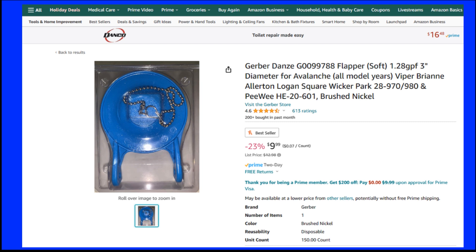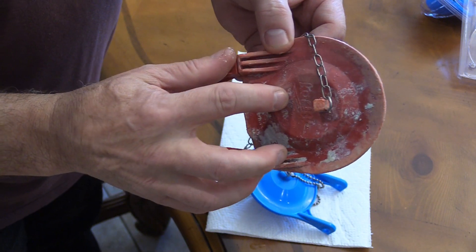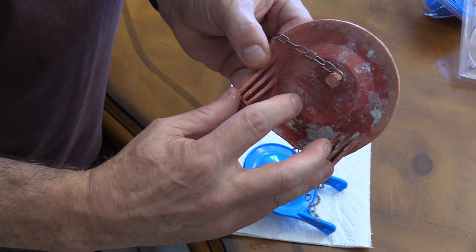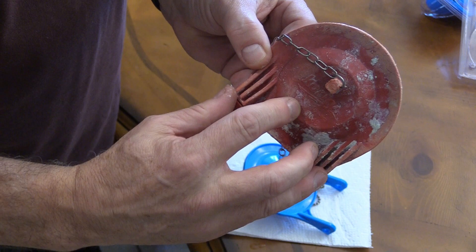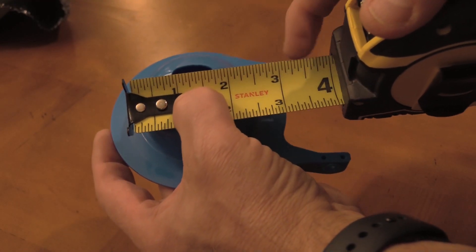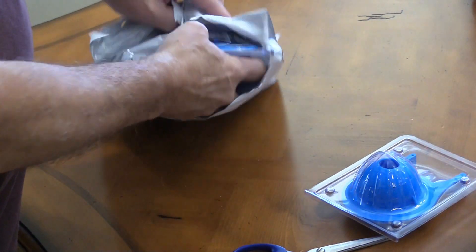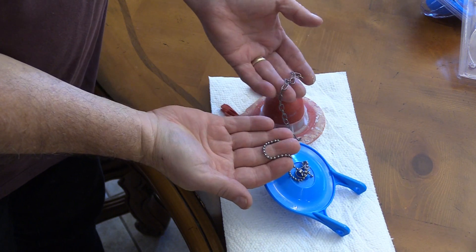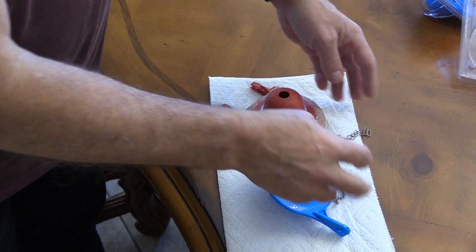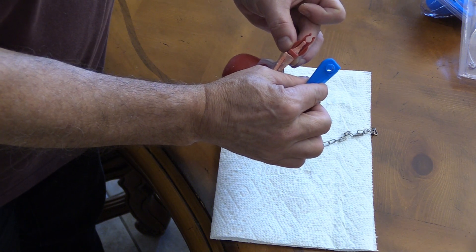You can purchase it on the manufacturer's site, or you can click on my Amazon affiliate link below and buy it straight from Amazon.com. You can also buy a universal flapper replacement. The one I removed from this toilet was a Corki — it worked fine. Make sure you buy the right size; this one is 3 inches, and you measure that by the diameter of the large ball in the center of the flapper. Due to the extraordinarily large number of toilets in this house, I bought a 5-pack straight from Gerber. You might notice some subtle differences between the two models — the chain may be different, and you'll notice how the flapper connects is slightly different.